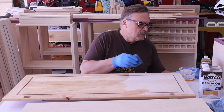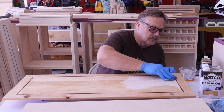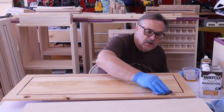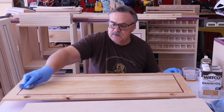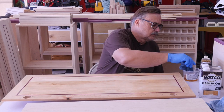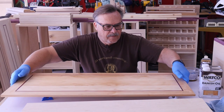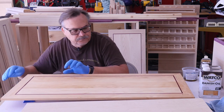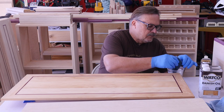Let's talk about seepage. On stuff like maple and purple heart, it's a pretty tight wood — you don't get much seepage. When you apply it and wipe it all off, you're pretty good to go. You don't have to worry about it later on, but I always come out about every 15 to 20 minutes and if I see any seepage I wipe it off. Now if you're doing something like walnut — which is pretty open and porous — or something like red oak, I found that seepage was a problem and you have to really watch it; it's going to seep through quite a bit. You can see how fast I did this side here and already this is all starting to dry.